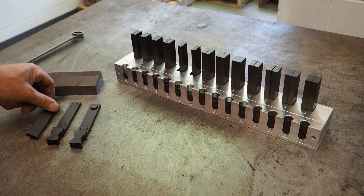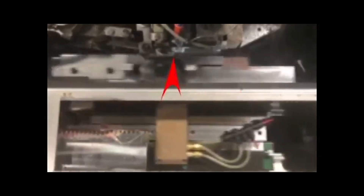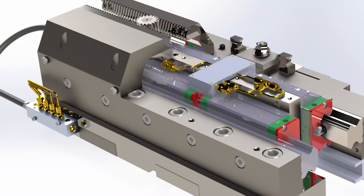anyone can operate Mule Technology with very little training. The patented use of linear bearings traveling half the speed of the RAM keeps the 60,000-pound capacity perfectly aligned with the center line of the screw during the rolling process.